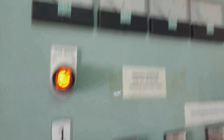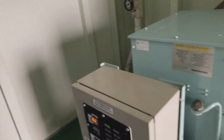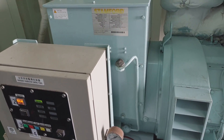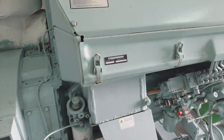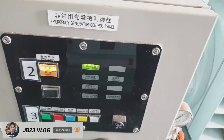Be sure that the engine is in auto position. Just press it and wait for the timer — wait about 20 seconds — to activate the emergency generator. At all times, our engine must be ready, so that in case of any power failure, this engine will be on standby and ready.